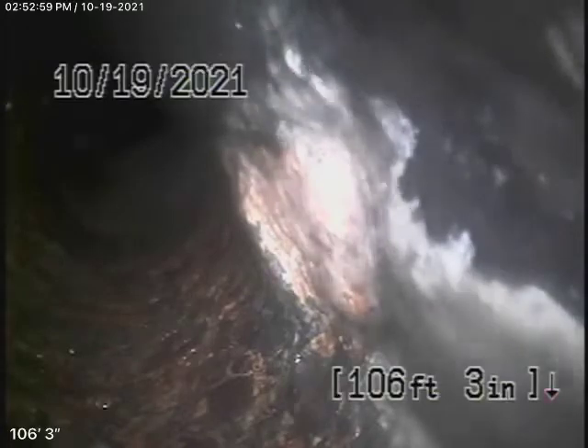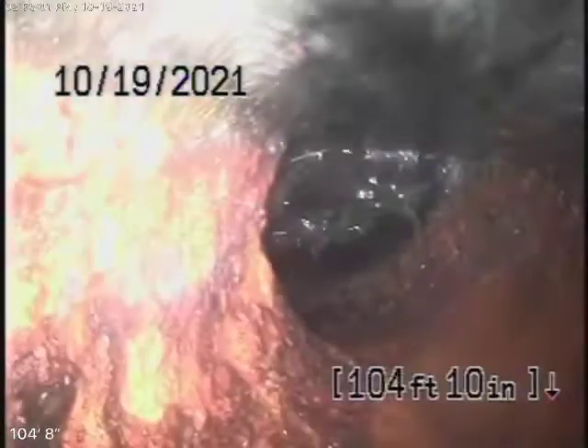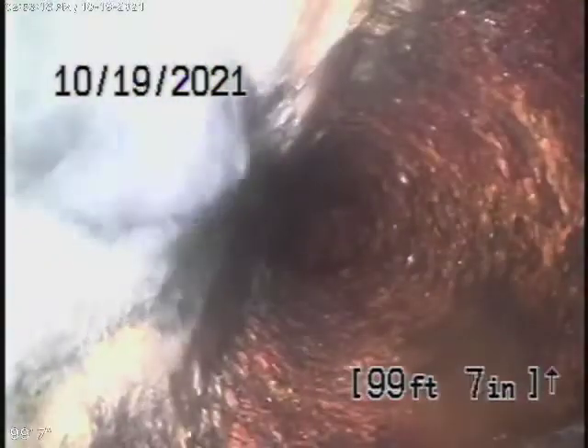We'll bring the camera back. There's just some debris that got flushed out of the line. It's diving down a bit here — getting older cast iron pipe obviously, but it's still functioning. There's minor rust build-up, really not too bad at all. Whatever you do, nobody should be flushing tampons, baby wipes, paper towels, or things like that. Obviously a little bit of periodic cleaning is always going to be necessary. In my opinion, it's functioning — you just have to be very careful what you flush.